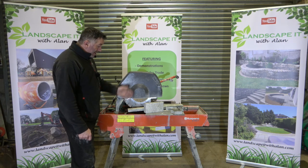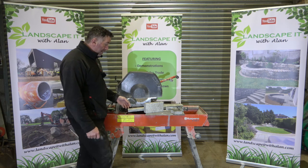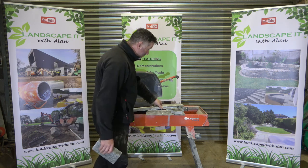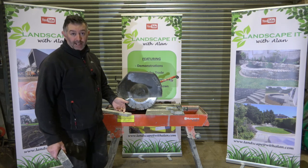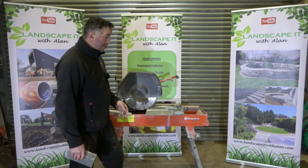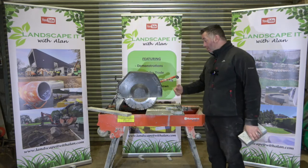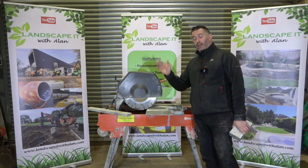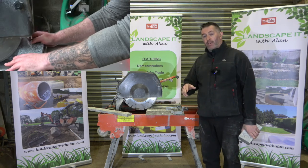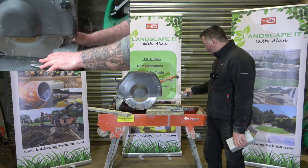The next thing is the cutting table — where the material is going to be placed. Some people call this type of saw a brick saw because of its range of cut. This machine has a 600mm cutting capacity, so if you have a 600 by 600 slab, you can saw that down the middle, saw 100mm off, 20mm off, whatever it may be, to work in the situation where you're cutting for.